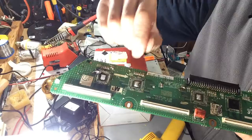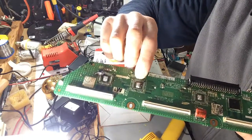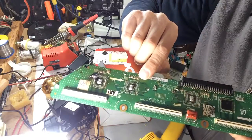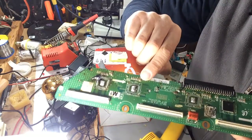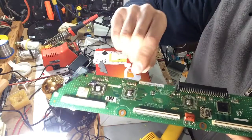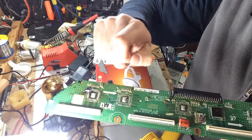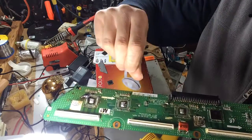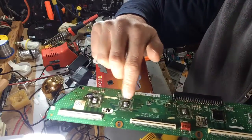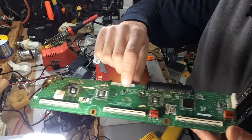What I did over here: I actually used a razor blade and cut all the legs off the IC, and then simply wedged my thin tweezers in one of the corners and lifted the IC. That happened rather quickly.